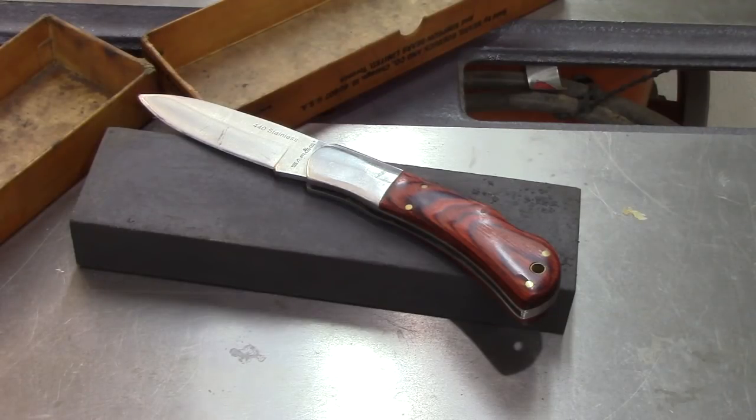You don't use stones on high-speed steel — it'll just take you forever. Keep in mind these old carborundum stones just won't hack it for high-speed steel, even though they'll do okay for your pocket knife. But frankly, once you go to a diamond hone, it's faster, easier, and less mess than those old stones.